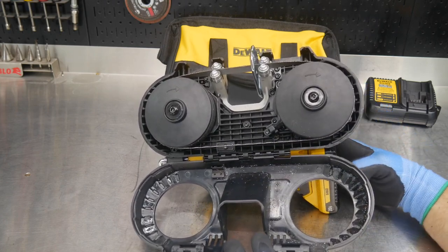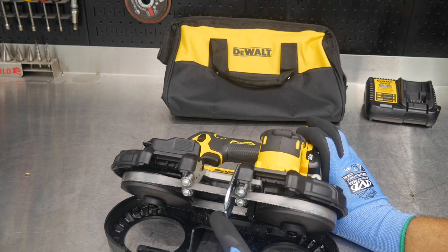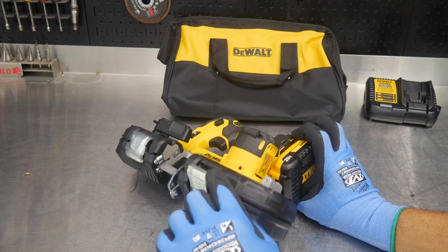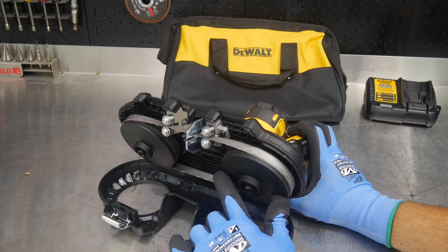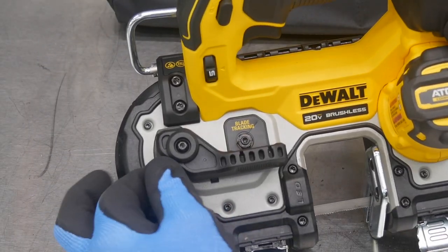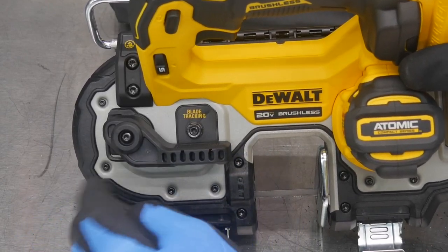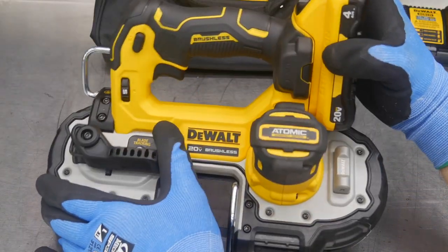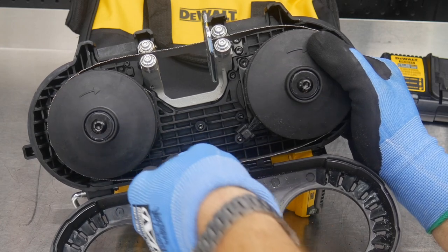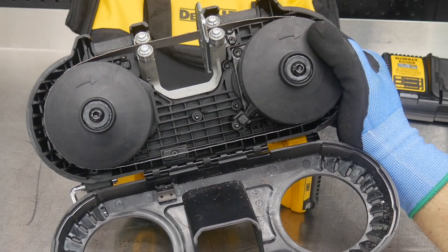We get brushes here to keep the wheel clean. The blade is a 14/18 TPI variable tooth blade — it'll cut most mild steel products with no problem. Double bearings serve as guide rollers to keep the blade tracked and prevent side-to-side jumping. We also have a blade tracking adjustment with a built-in Allen wrench to set tracking if the blade starts to walk. To release the blade, no tools are needed — open it all the way, take the blade off or put it back on, then closing it tightens the wheel back up.